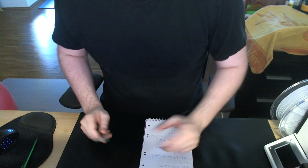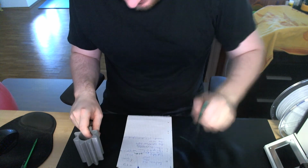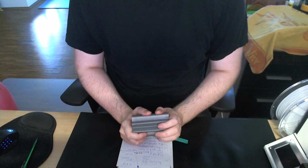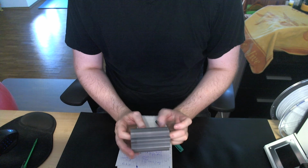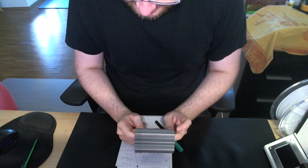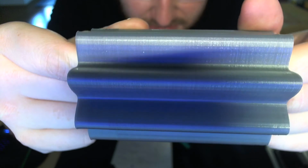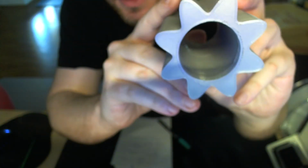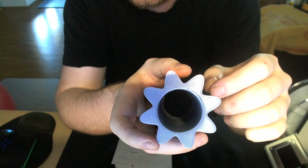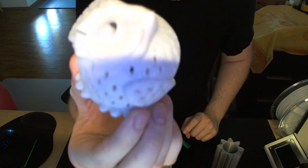Nice start. Print quality. That's also something I want to say. I have several prints made at the maximum and minimum layer height of 0.1 millimeters, but I have to be honest, they rather failed. Well, that's not my biggest concern. I rather like the look of 0.2 height. So, as you can see, they're quite true to form. Everything seems fine. Maybe here, but that's overlay settings. That's my failure.